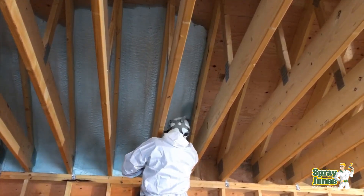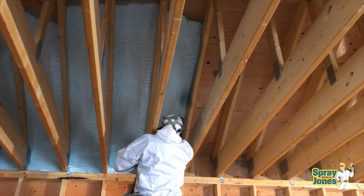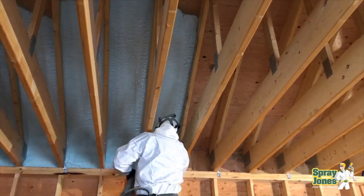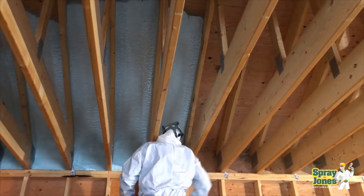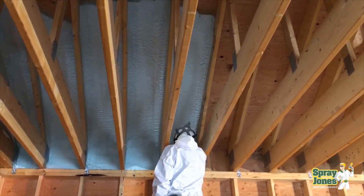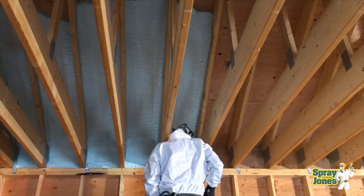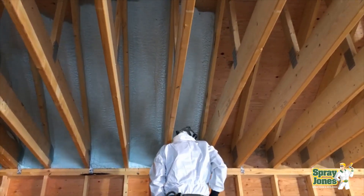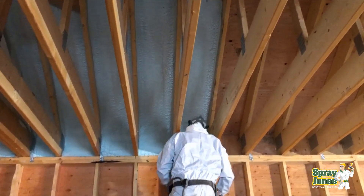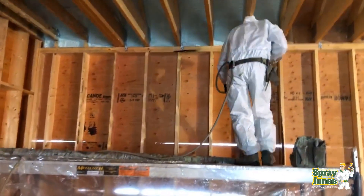Now coincidentally, the roofs generally don't have a problem — the roof was shingled early on. So the ceiling sections we sprayed were all fine. The foam stuck just fine; didn't have to do any remediation there at all. But in this situation, the walls — especially on the north side of the building where it was in the shade — the foam that had disbonded, we just grabbed it and pulled it out. It wasn't really staying in there very well.